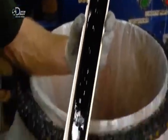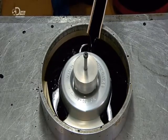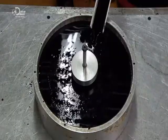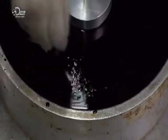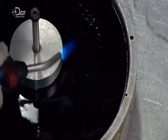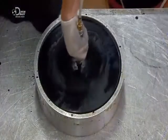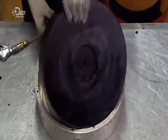To make each half of the mould, they centre the model in a base, then fill the space around it with polyurethane elastomer — a solid type of polyurethane, as opposed to the foam type used to cast the tyres. They stir gently to move air bubbles to the top, then heat those bubbles with a small propane torch to burst them. With the help of a heated table, this material solidifies in approximately 15 minutes, at which point they extract the half mould.